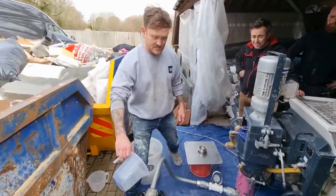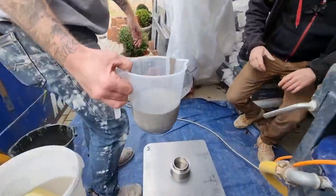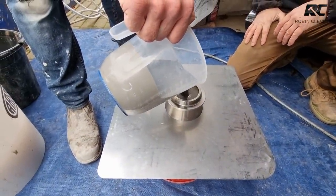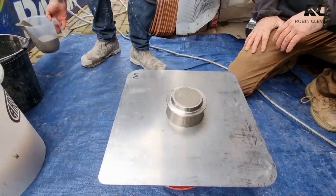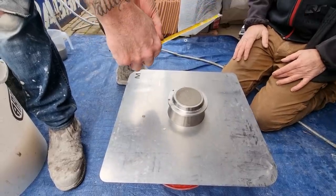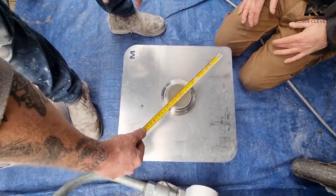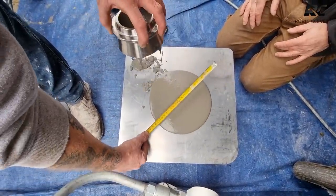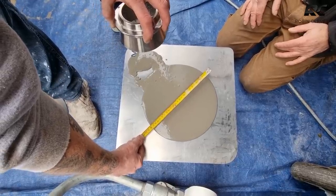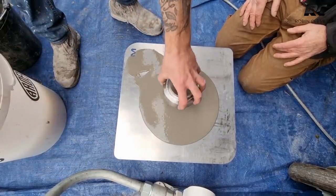What we're looking for is somewhere between 29 and 31 centimeters — that's really precise. So when you pull that cone up you're hoping it will run out to that mark. We're pretty much there; we might just give it a tiny bit more water when we get inside.